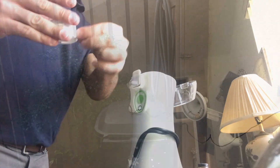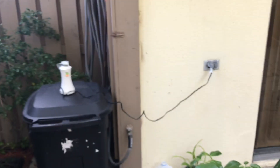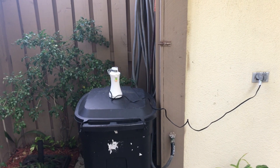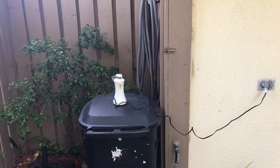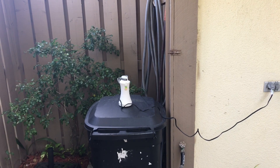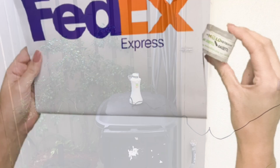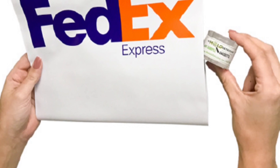You are going to want to test the air quality outside as well. The reason for this is there will usually be some mold spores inside, which is normal, but the key is to hopefully have less indoor mold compared to the exterior. I set the pump on top of a garbage can because that was the best thing I could find, and once the sample is finished, I will put the samples in the envelope and send it off to the lab to be analyzed.